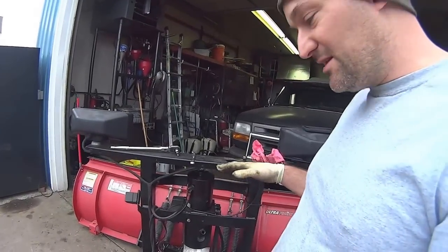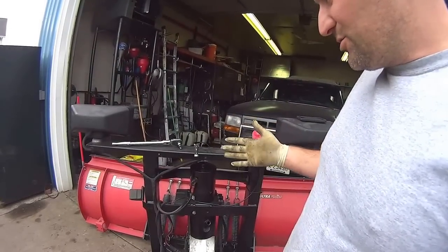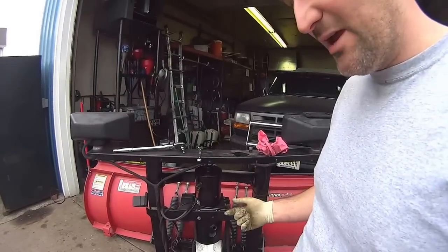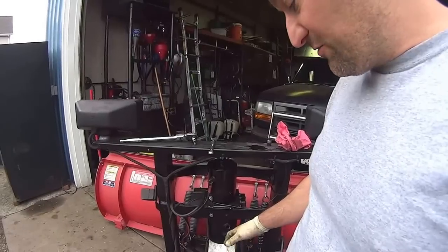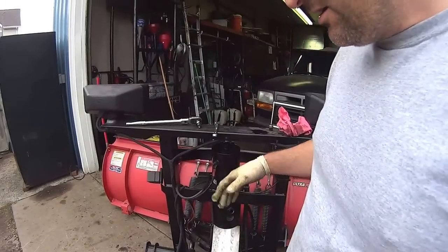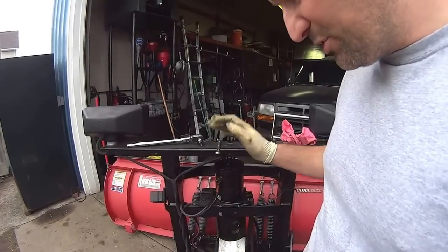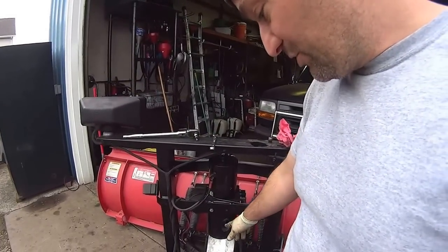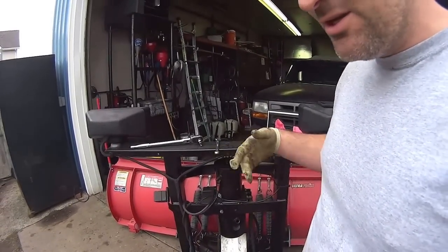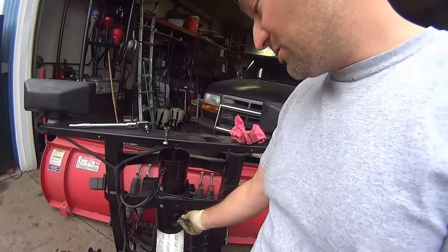What you should do is have this connected to a truck. Push the tongue down and work the plow back and forth to get as much fluid out as possible. Fill it up to the top, put your plug back in, connect all the electrics, lift the plow up, put it side to side, then put it down. With the tongue all the way down, check the level — it should be low. Fill it back up to the top, do it one more time, check your level, and once you're good, put your plug back on.